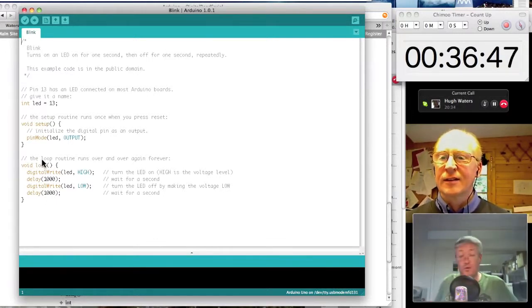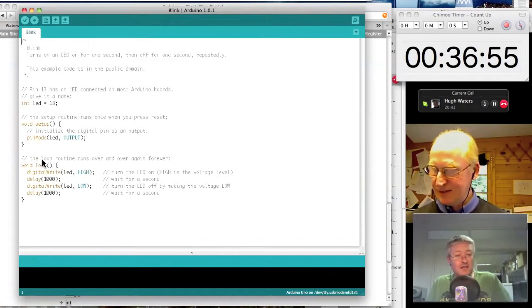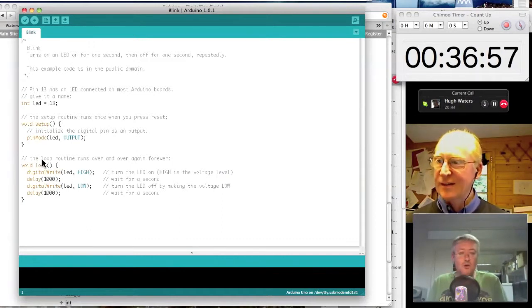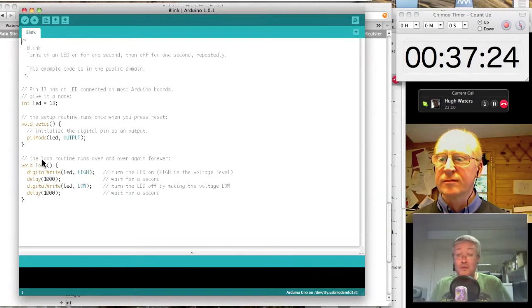The little Arduino project I'm working on at the moment is to read VTR timecode and do things with that. Now, it's been done 100 times before. You can go to Mr. Hi-Tech and he'll sell you very nice boxes. There's a company in Las Vegas called Adrienne Electronics, and they do lots of not quite custom but sort of solutions to allow you to extract time code from a 422 stream and embed it into the vertical interval of another video signal. So all those things are done already, but if you've got a slightly off the beaten track requirement, you can probably do it with an Arduino.